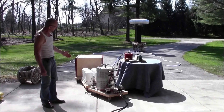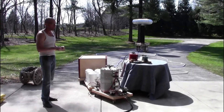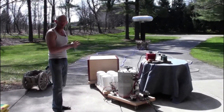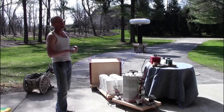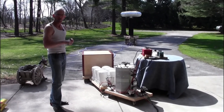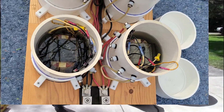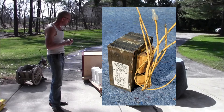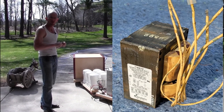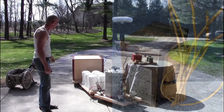From the variac, the next stop is the inductor bank, which serves to choke the current on my coil. It consists of six 1,000-watt metal halide ballasts that have had the magnetic shunts knocked out of them. Each one of these six cells is submerged in a pot filled with mineral oil, used primarily to insulate the inductors in the event of short circuits or transient voltages.